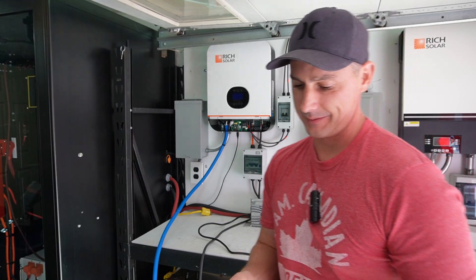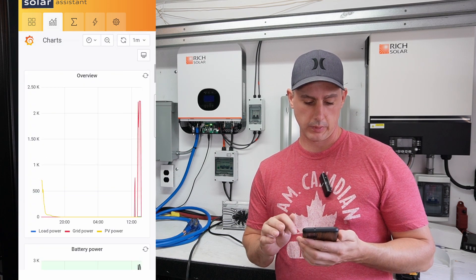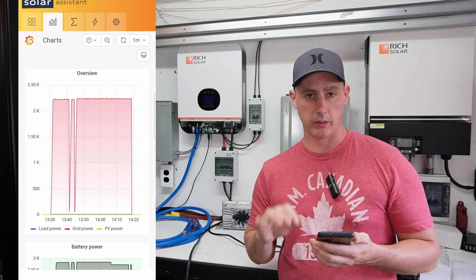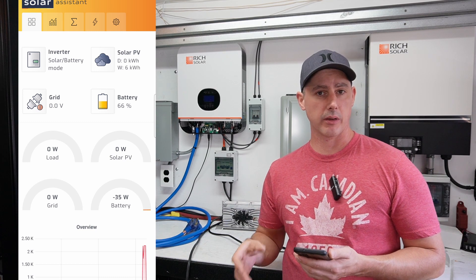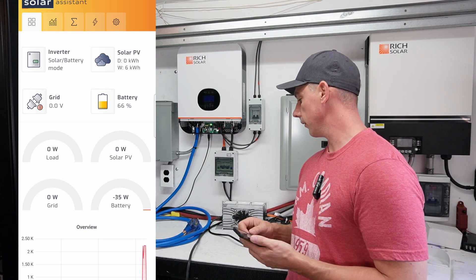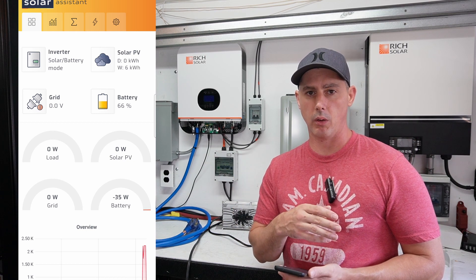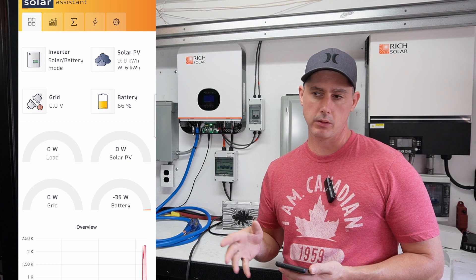The vac truck is gone, so I've shut down the generator. Looking at the charts for the last hour, I got almost an hour's worth of charging. I didn't get up to 100%, but maybe I'll do the rest just off the grid — I'll wait for an off-peak time to save a bit of money. It's always good to pull out your generator and run it for a few hours just to make sure everything's running good. Now what I'll probably do is refuel it with the True Fuel and then do an oil change. Everything worked out really well. I did notice I ramped up my amps to like 50 amps, but my generator wouldn't go above about 2222 watts on the output for that one 30 amp plug. Not sure why it wouldn't go any higher, but it still did exactly what I wanted it to do.